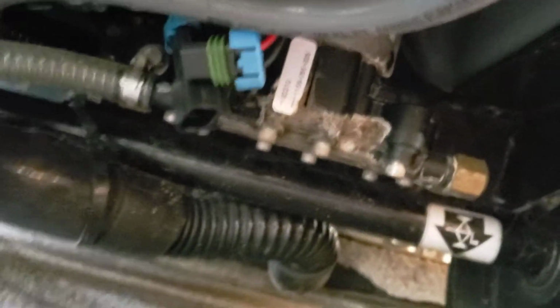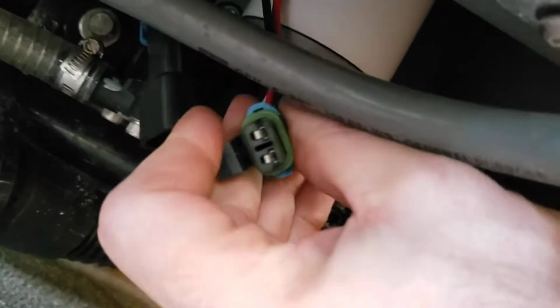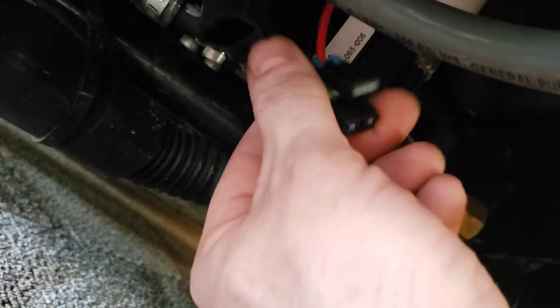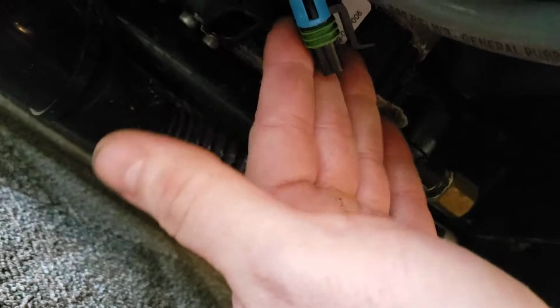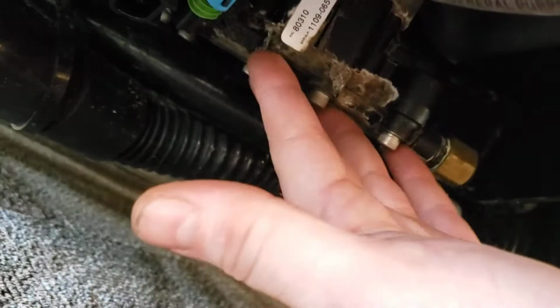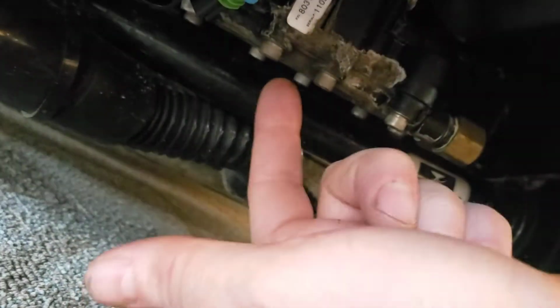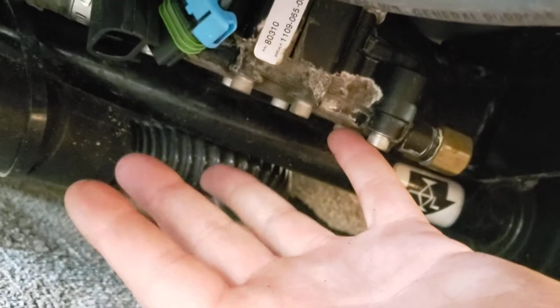It wasn't operating. So either the pump motor shorted or it was clogged up and seized and was pulling too many amps on startup. So what I did is I disconnected this, and you can test that for continuity and then continuity to ground, and the pump motor ohmed out good at like 0.7 ohms for resistance on the windings and nothing to ground. So the pump's motor is good, but what I found was that it was clogged up and couldn't spin the impeller even though the motor was trying, and that over-pulled the amps and blew that fuse.